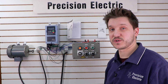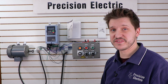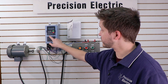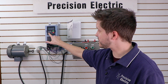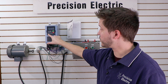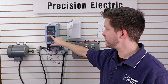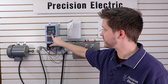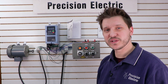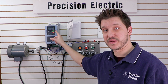Now when we go into the next video we're going to be wiring our push buttons and we are going to have to make some program changes, but out of the box the SVX is pre-programmed for selector switch control. So once I get booted up there's one more step that's absolutely essential — there's a local/remote button on here and when you press that you need to be able to switch to remote. When I press it and then press enter it will allow me to switch between local and remote control. The only way my I/O on my wiring here is going to work is if I'm in remote control.